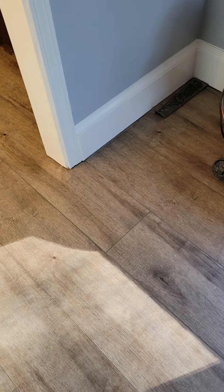I make a mark there, then I'll take the same board, pull it up, and go anywhere in the middle here because my next one will hook in. I'll make my mark a little bit back and square this off, and my floor will slide right in. Once you get your board cut, slide it in and see how much gap space you have — make sure you push it all the way in.